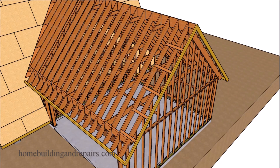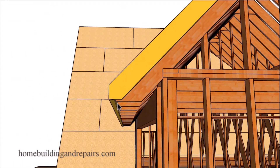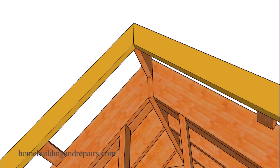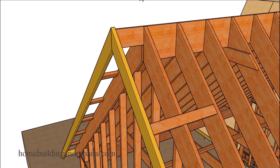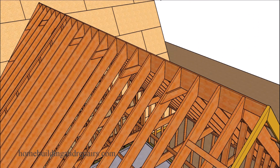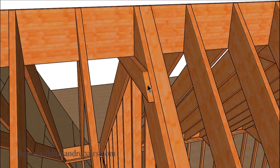These boards connect to the 2x4 wall framing studs to provide strength and prevent the wall from moving in and out. You can space these braces closer together — I have them at 4 foot on center, but you could use 32 inches on center to make it stronger. Let's add our fascia board. If you're going to install a soffit at the bottom, it will come across this area and you'll end up with a different section — there are a variety of ways to finish that; let me know in the comments if you need more information. Lookouts are going to be spaced 32 inches on center and collar ties 48 inches on center. Try to line the collar ties up with the rafter ties. We're going to move the collar tie to the left side so it doesn't interfere with our drywall.